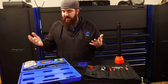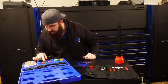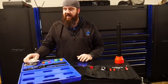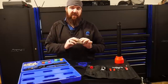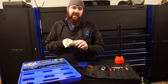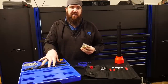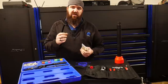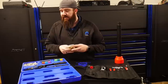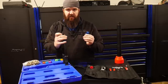The different bits cover everything from an M5, M6, M8, and then in the standard sizes it comes with a 1/4-20, 10-24, and a 5/16-18. The really cool thing I like about this kit is it comes with a whole bunch of bags of rivnuts as well. So not only do you have the tool, you've also got the rivnuts to be able to install. They do have the knurled ends to keep them from spinning when you go to put the nuts in, and this tool does install them very nice and tight. You're able to adjust the depth on it to pull a little bit more if you really need to, with the tool end for installing the different tips.